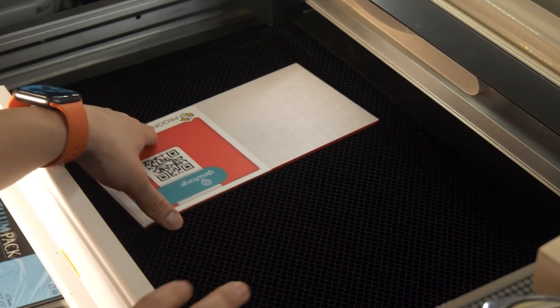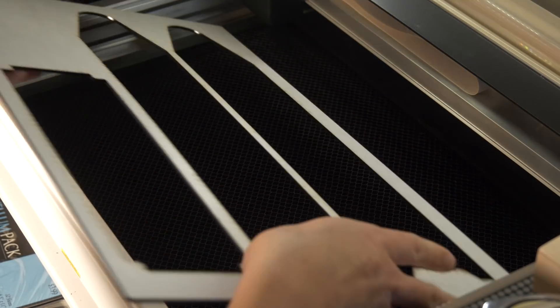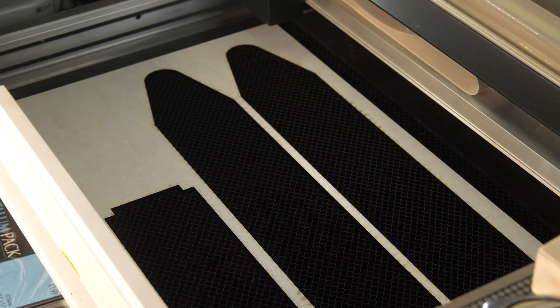Now we throw this into the laser cutter. I have my acrylic sheet, five inches by ten inches, but I don't know exactly where it's going to cut on the laser cutter. If I want to cut multiple pieces or do multiple passes, something we can do is take a scrap piece that fills the entire bed and create a jig. This full sheet goes into the bed of the laser cutter and I'll cut out a hole representing the five-by-ten-inch piece, so I can place any sheet of that size perfectly nested - every time I use that design with this jig, it'll line up perfectly.